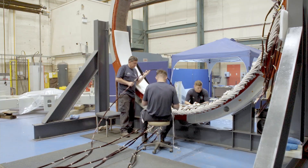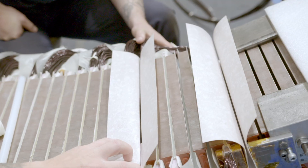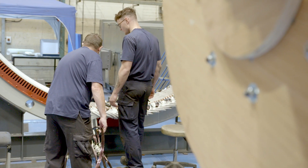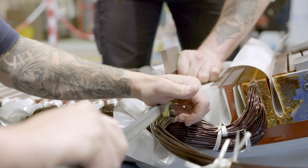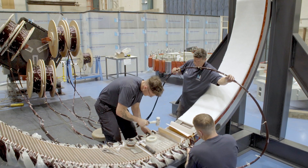When discussing with our team, we decided to upgrade the machine's insulation properties. We've gone for a class three enamel copper, which is a much higher grade — it's actually got a breakdown voltage of about 15,000 volts, and this machine runs at around 480 volts, so it has a very high dielectric strength. On the slot liners, we fitted Kapton Nomex and 0.5mm Nomex, which has given it really good dielectric strength plus mechanical strength.